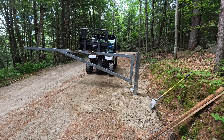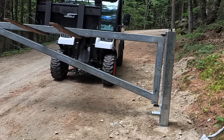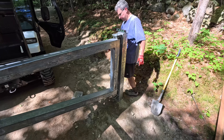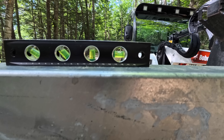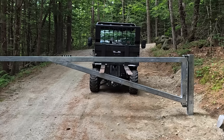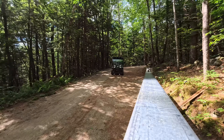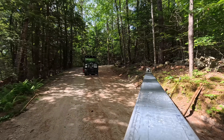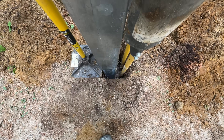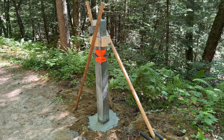I've got both bearing support plates in position and I've got to place the gate in the middle. But I'm doing this all by myself and can't exactly see what I'm doing, so I went really slow and got out of the machine a bunch of times. With a bit of finesse I got all the bolts in and slowly tightened them until everything was snug and I could remove the forks supporting the gate. One of the most important milestones installing any gate — the thing is supporting itself, maintained level, and nothing fell over. The other post isn't doing much — it's just a latching point — so I hand-dug that one with a post hole digger and used 10 bags of concrete.